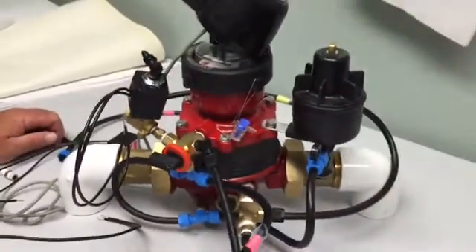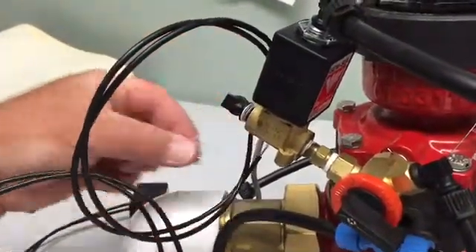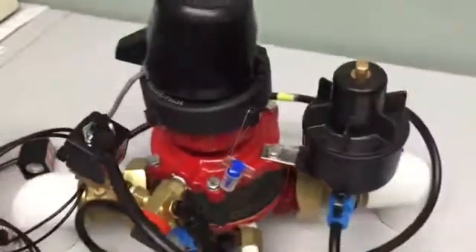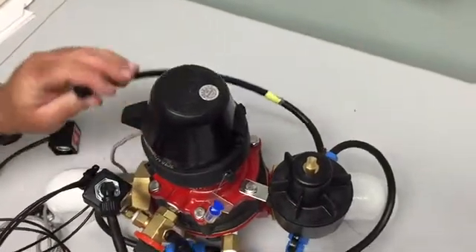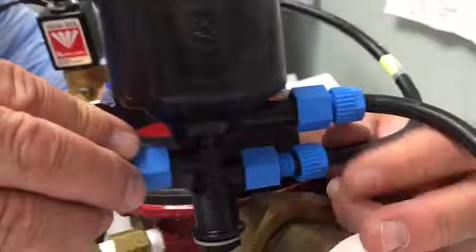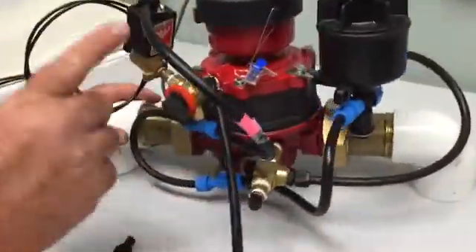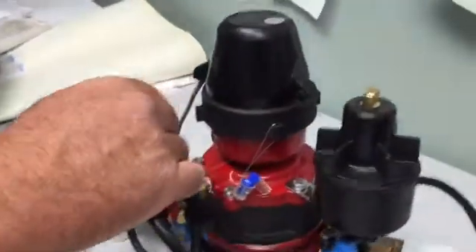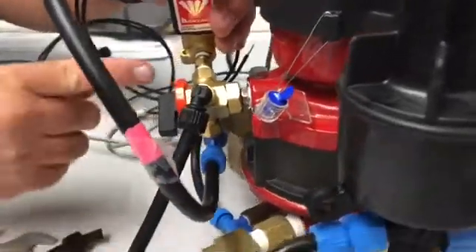Our new solenoid has been repositioned. We've got the solenoid base on, and we're going to put the little plastic 90 back into the back side of the solenoid. Now we're going to reposition two of the tubes on this device. The first tube to reposition — the one that was at this 90 going into the second port of the pressure regulator — is going to be removed. The other tube we need to reposition is the pink tube that comes off the top of the solenoid; that goes into the T mounted onto the indicator selector.